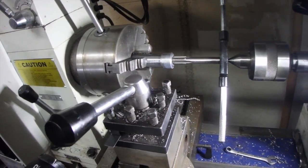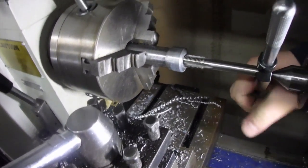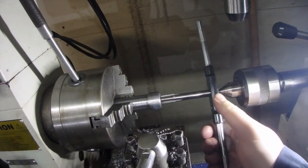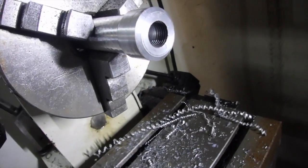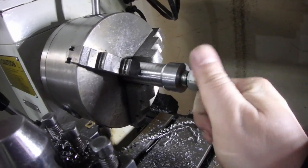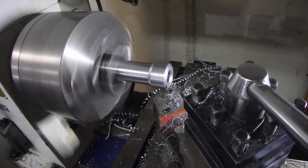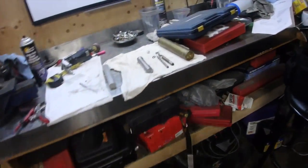It's a little bit on the tight side but I think we're gonna make it work. I just got to punch in there to kind of jam it so I can lock the chuck while I spin my tap — but can't get too crazy because you don't want to bind it too much and snap it off. I think I got enough thread cut there. Let's see if I can screw that in — perfect. I think I got my groove right where I need it to be.